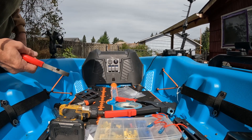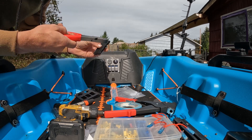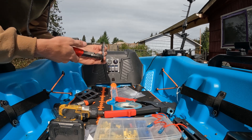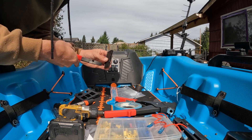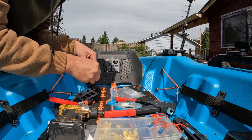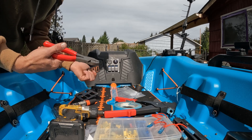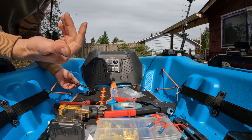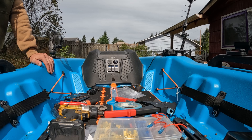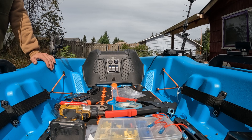This plastic is interesting — different plastics do different things when you melt or cut them. Some plastics stay gooey and go back to the way they were, but this plastic is harder and more brittle, so when it gets hot you can just pull it off with pliers or your fingers and you're left with that nice edge. That was something I should have thought about sooner — I don't know why I didn't.